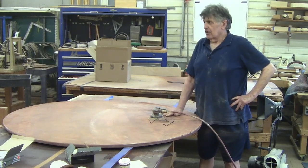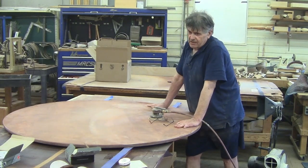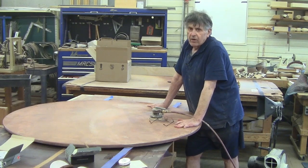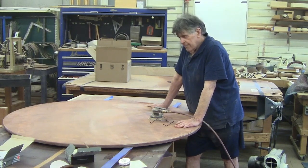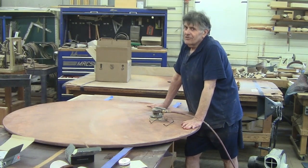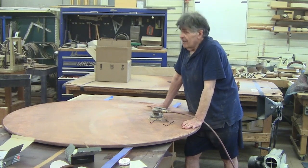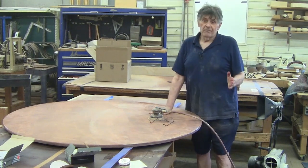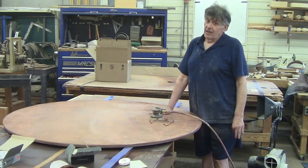Now again, I've got a good heavy coat of sanding sealer. Normally I do not use sanding sealer because with water-based, well, any of them, I really don't have to. But in this case, and I know I've told you, that conversion varnish, well, it's a little tough. And I'll be honest, this is General Finishes. This sanding sealer's pretty tough too. Now, sanding sealer is designed to be a lot easier to sand as a first coat. But I'm telling you, this stuff's tough.